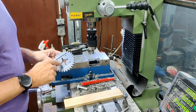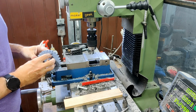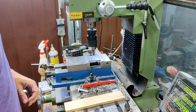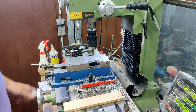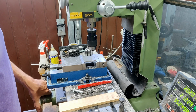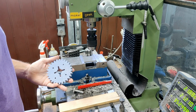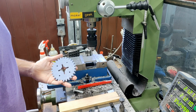So first thing, I'm just going to go to each corner, drill and tap a 5mm, so the 3D print will bolt into the metal plate. That should be easy. I think I calculated this should be 21.21. So I have some slightly odd measurements, because in the CAD I set these 30mm out from center. I could do a whole pattern to get at 30mm, but it seems fairly easy just to calculate the X and Y offsets for that, which is 21.21 or thereabouts.